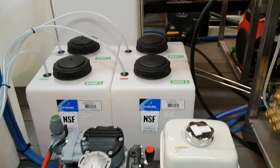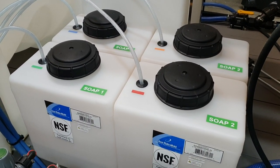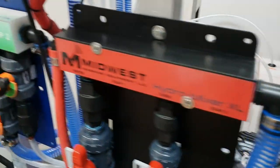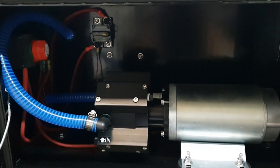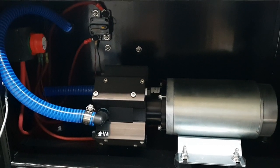This particular unit has 4 soap tanks or surfactant tanks. The soft wash pump is our new X-series — high pressure, 12 volt. It's housed inside this box here, protected from the weather. It's 5.2 gallons a minute, 150 PSI.